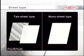There are two types of Prescale film. One is a two-sheet type for the pressure range between extreme low pressure and medium, 50 kilopascal to 50 megapascal. Another is a monosheet type for the pressure range between medium and super high, 10 megapascal to 300 megapascal.